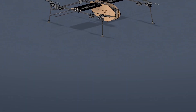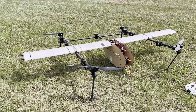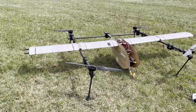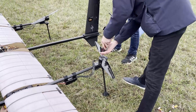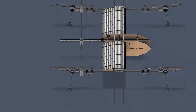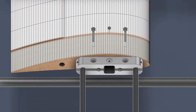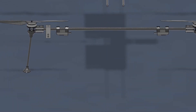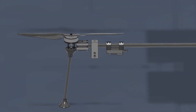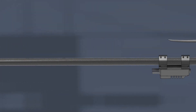For quadcopter flight, our four main motors are T-motor V807 KV170 motors in conjunction with 27-inch carbon fiber propellers at a pitch of 8.8 inches. This motor assembly works together with four T-motor Flame 180 amp ESCs, ensuring that no matter the conditions, the ESCs have a large enough safety margin for our motors rated at 150 amps max amperage. This full quadcopter configuration gives us a total possible max vertical lift of 79.4 kilograms.